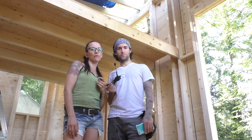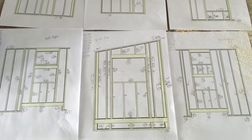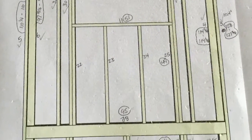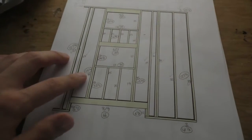In this video, we're going to show you how we framed and raised our walls. Before any cuts were made, I printed off each wall on their own from the model so we'd have some plans to go off. Then I assigned a number to each piece of lumber and an abbreviation for each of the six wall sections. Using the tape measure tool in SketchUp, I carefully checked the dimensions of each board, then wrote that number down next to the corresponding piece on the paper.